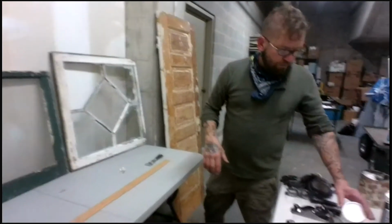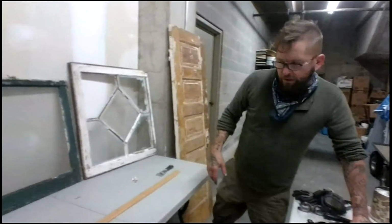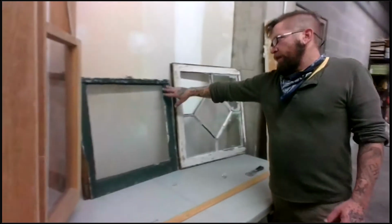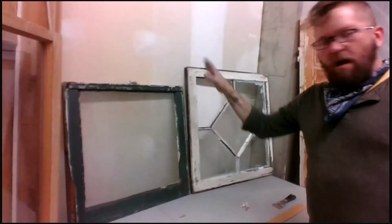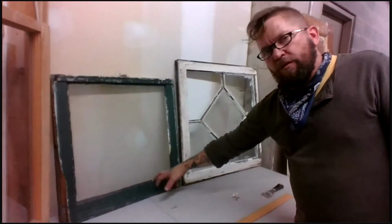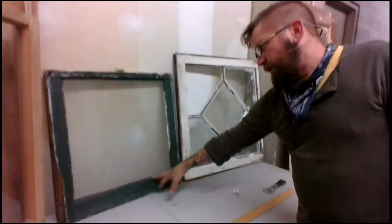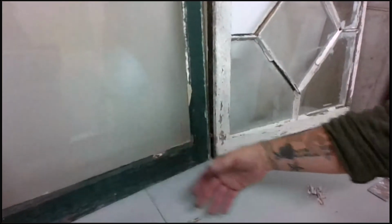Because by the time you're done with the whole window, you'll be a pro at glazing. And that's another recommendation: if you have to take it all out, replace all the glazing. Don't patch. If you have a bit of cracked glazing on any window, you want to remove all the glazing and start with a new material, and do the whole window,